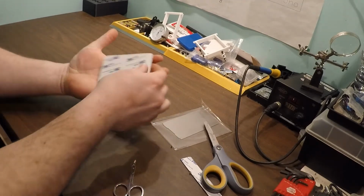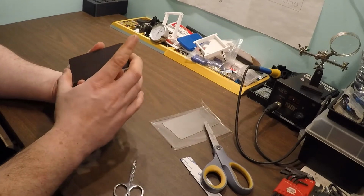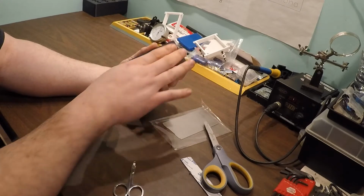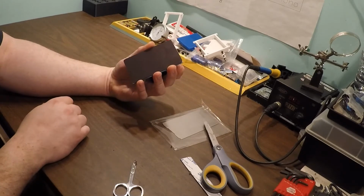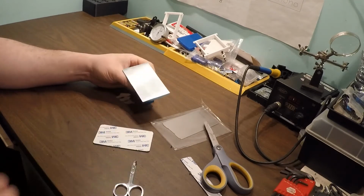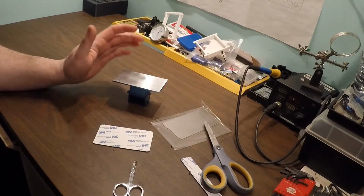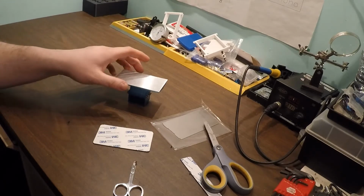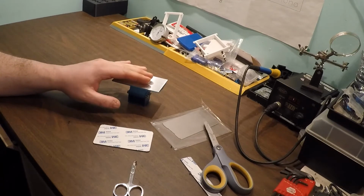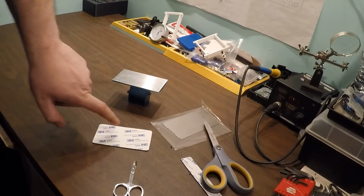So there it is, that simple, just some couple radius. Make sure this is all copacetic. Absolutely it is. As you can see, we can see each corner, so the radius doesn't interfere with nothing. Nothing will get hung up. So let's get this installed. Basically, we need to wipe this down with isopropyl alcohol or grain or whatever you'd like to use. But very important that this is very clean and free of debris before you put the magnet sheet down. So I'll be right back.